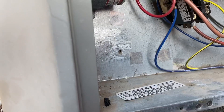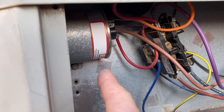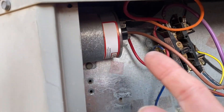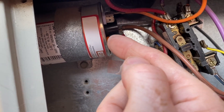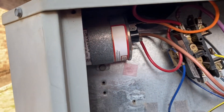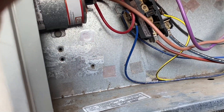Hopefully that helps. If you see liquid coming off the capacitor, or if it has a sort of mushroom-topped bulge, that's probably your problem. Hopefully this saves you some time and money. That's it — thanks.